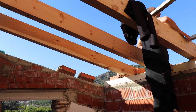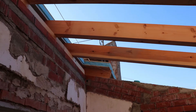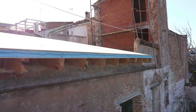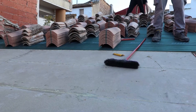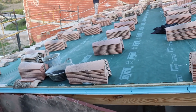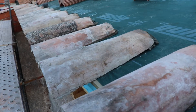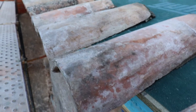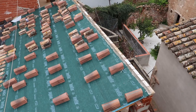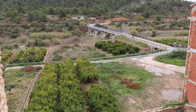There are a few panels missing so the bedroom area had to wait until later — it shouldn't really be a problem in sunny Spain normally. On top of the panels goes an impermeable membrane which is stuck down, and then the roof tiles go on top of that. We used new roof tiles in the gullies, or the rios, and then the older tiles, which are more attractive, go on top — the sort of ridges called caballon in Spanish.